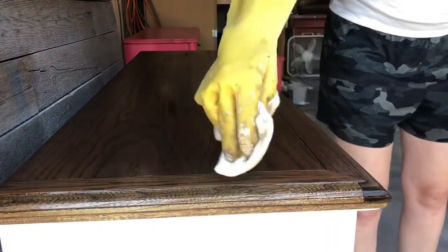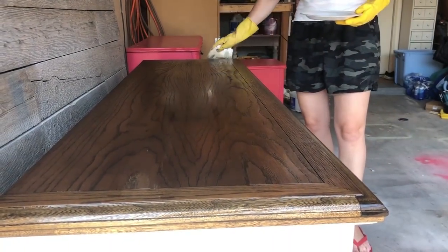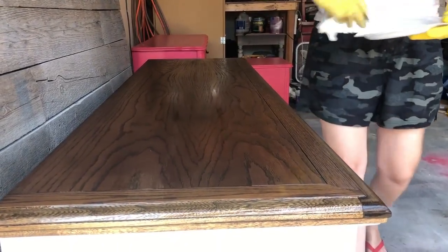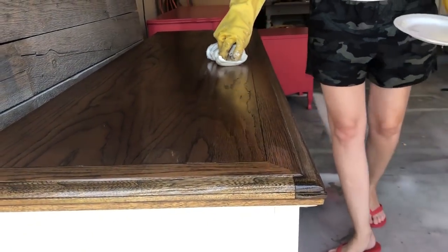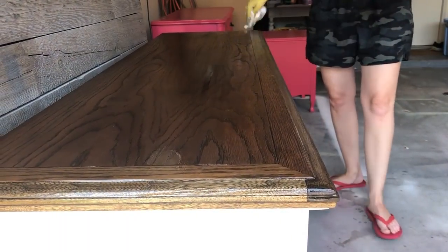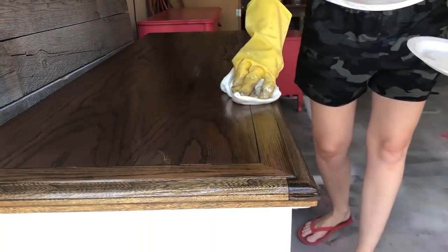The trick to this Wipe-On poly is to not overwork it. You can see it when it goes on. It is very shiny on the top, so you can see where you've been. So you'll put on typically about 3 coats on a top coat. Just let it dry really well in between, and then it dries to a nice hard diamond finish.